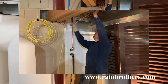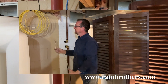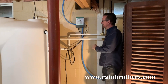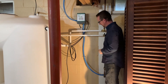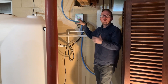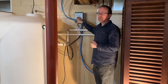On the electrical side, there was wire running up with the water line, going along the joist to the pressure switch on the pressure tank. We interrupted that wire right here, cut it, and ran it so that instead of going to the pressure switch, it now runs directly into our Little Fuse pump saver. This device detects whether there is water in the well. We have other videos linked in the description on how to wire this pump saver.